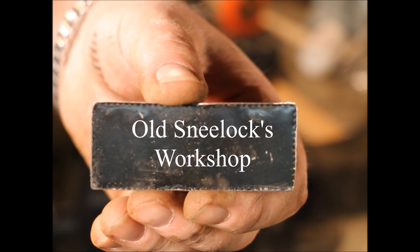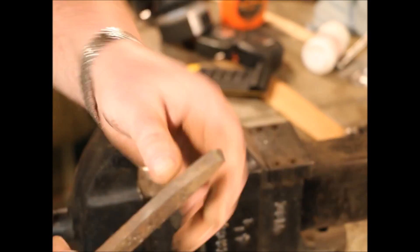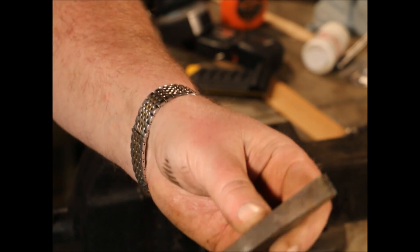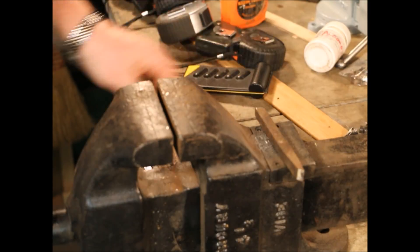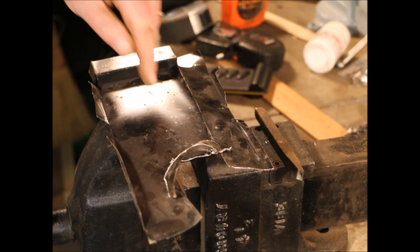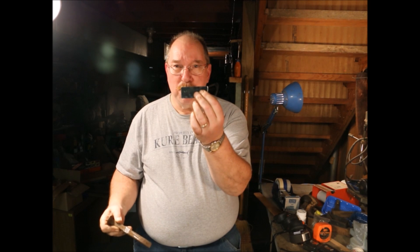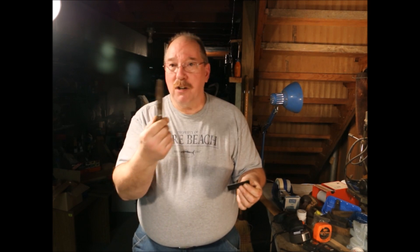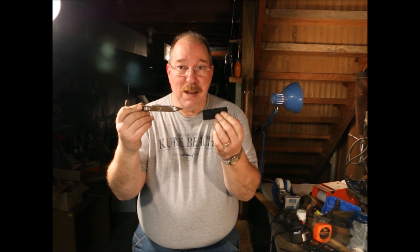And there's a completed tag out of a piece of scrap metal, cut with only a hammer and chisel. Nothing fancy. This is just an old piece of hardened tool steel that has been ground to make a single-bevel chisel. This is a piece of an old dryer cover. You don't need a whole lot of fancy equipment to cut a groove in a piece of steel or to cut a tag. I could have used the power saws, milling machine, drill press, grinder, or any number of things — but a chisel and a file, and an appropriately sized hammer, one pound or 12 ounce, either one worked just fine. Some of you guys asked about chisels — well, I gave you chisels.